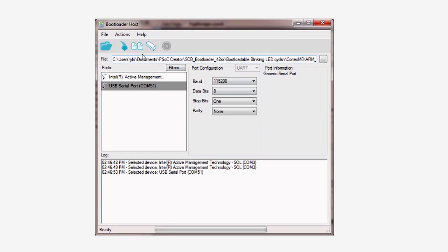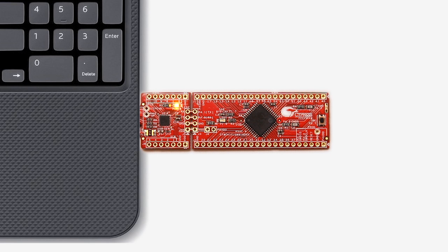The CYACD stands for Cypress Application Code and Data — that's the equivalent of the hex file in bootloading. Press the download button and your project will now be bootloaded onto your board. See how the new application runs immediately? You can see that the LED is blinking really briefly and then it's off for a noticeably longer time, representing the 5% duty cycle that you set when you changed the compare value in your PWM.